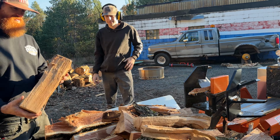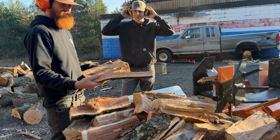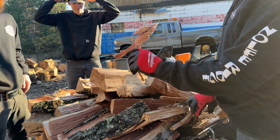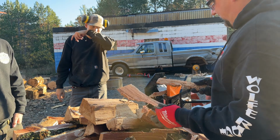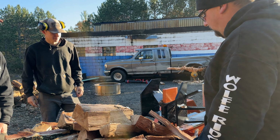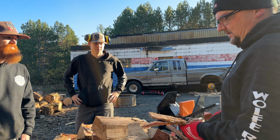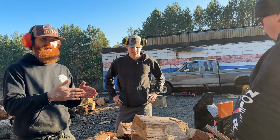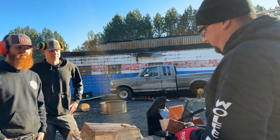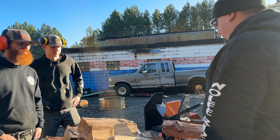There's like, yeah, you got square split stuff, there's small stuff, there's medium. Some kindling, there is some chaff. Yeah, this gets some complaints from the viewers, but the people that actually use the machines know when you put multi-way wedges on, this is something that you get. Do a box wedge, you'll get a bunch of it. It's so many different angles that you're splitting the grain up. But if you want to make a lot of firewood in a hurry, 12-way is kind of where it's at.